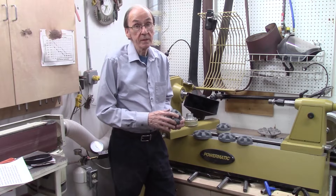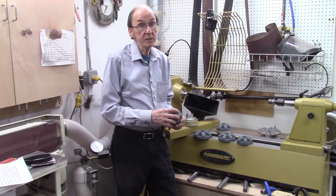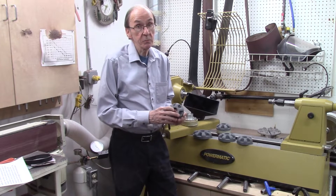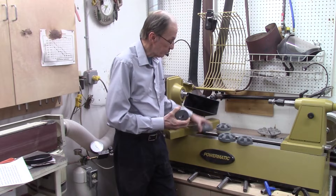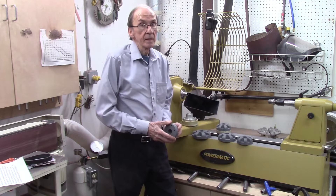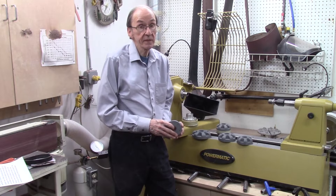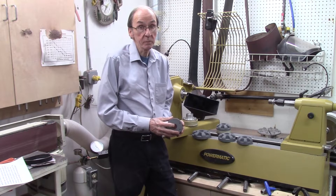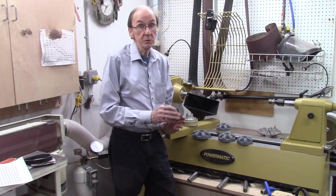In this video, I'll be describing the design of these faceplates using the Fusion 360 software, the design changes I made to make them as strong as possible, and then actually printing these out using my 3D printer. I made several sizes of plates, going from a 3.5-inch faceplate up to a 5-inch faceplate. After these faceplates were produced, I did some structural testing on these — drop tests, shatter tests — putting them in a vise and hitting them with a hammer to see how strong they would be. And then finally, I'll be showing the actual turning of some of the segmented eggs using these faceplates.